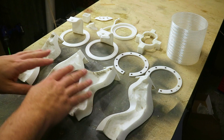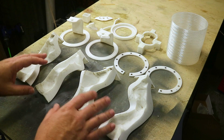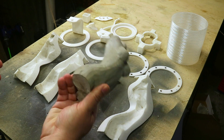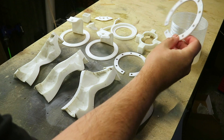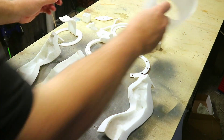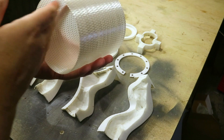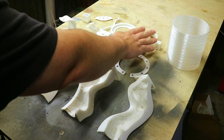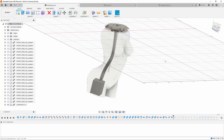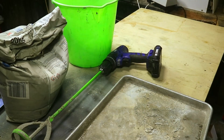Starting with the 3D printed parts: you've got the molds on the outside — it doesn't matter what color you print these in. The molds take a little while to print but you can use them over and over again. You've got these rings which hold the NeoPixels in place and clip on top of holders, keeping the lampshade in place. The lampshade is made with clear PLA — white PLA won't work because the lights won't shine through. It has knurling on the inside and smooth on the outside. The mounting brackets hold the mold in place when pouring concrete. There's also a tube for running wires from the base to the top, a mounting bracket, a blank, and a little holder for the circuit board.